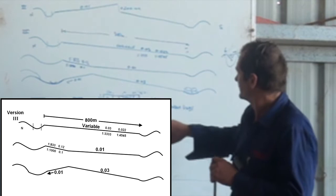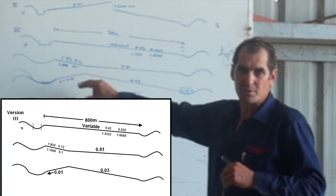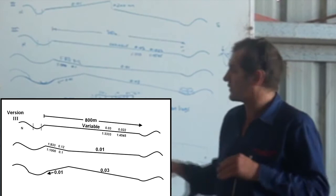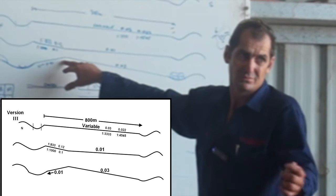Then there's this block here — you can see where we stopped on that bank, that bit of a line? That's about 80 metres into the field. It's actually a real slow grade up — on 100 metres it'd be 10 mil. Where it launches into here is only a 10 mil rise, then it runs all downhill at 0.03, which from there to there is probably 700 metres — something like 120 mil, four or five inches down to there. The water actually hits here, the wheel tracks come out first like most siphon fields, but it backs up to about here.